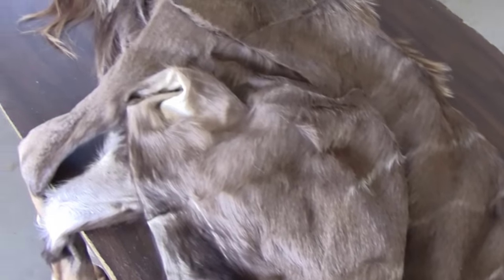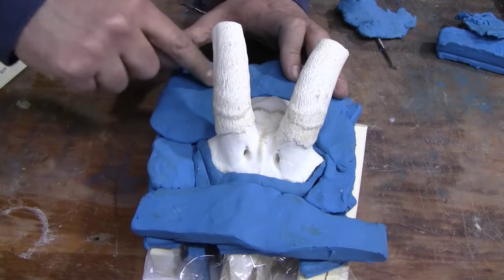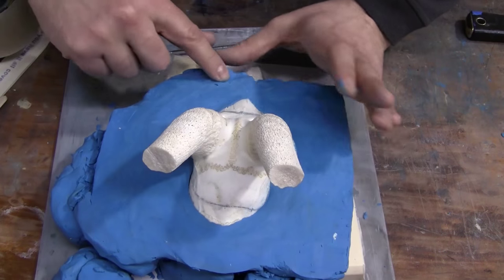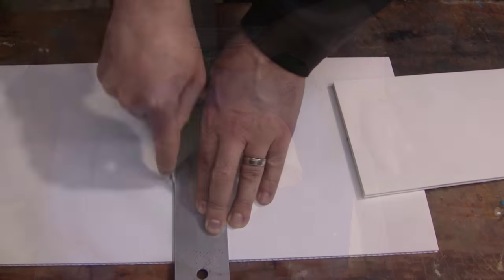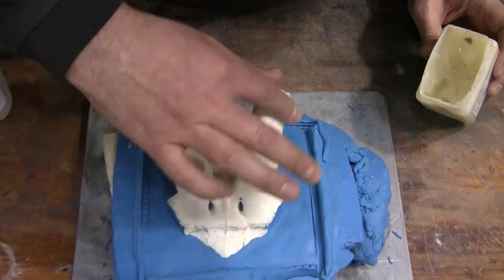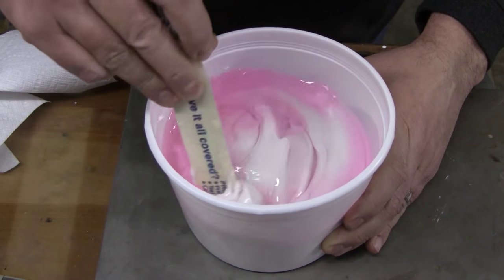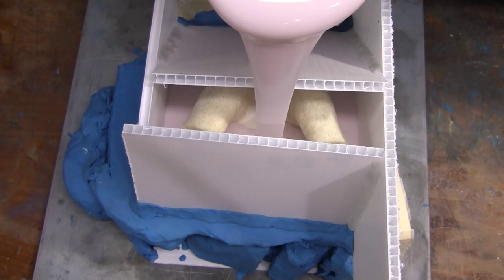We want to show you two different ways on how we helped Jerry make these skull caps. First was a smaller animal, where we were able to make a block mold by simply claying up the bottom, sealing the horns and the skull, making a conformed mold box to the shape of the horns to minimize the silicone required, then mixing and pouring the rubber over the skull.